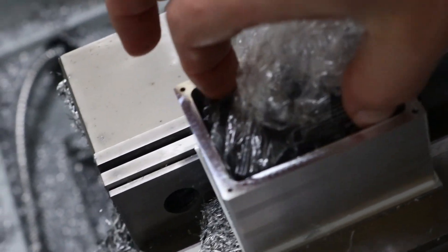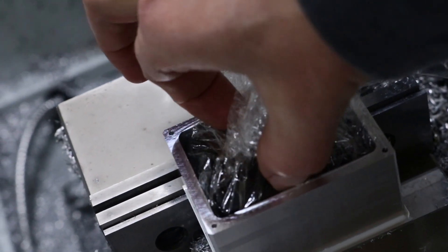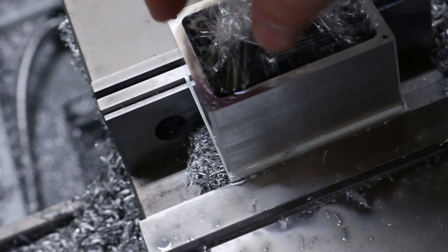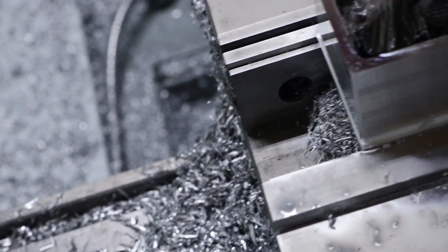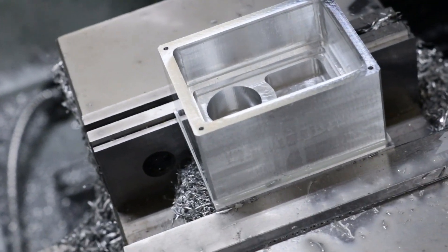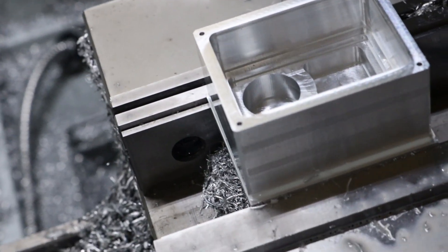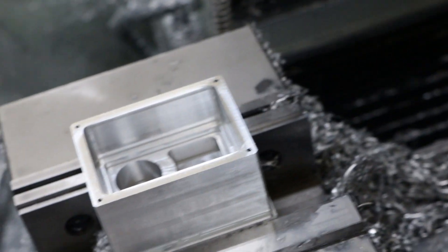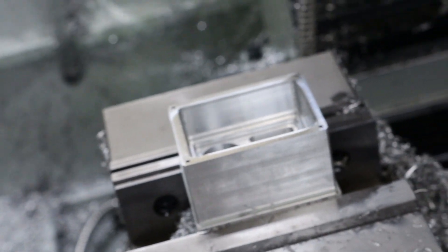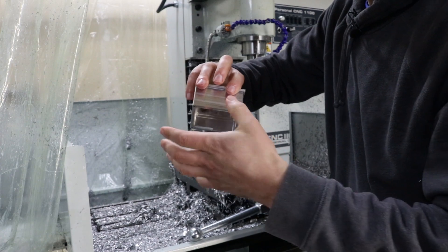You can see it kind of sits in that front plate that I showed in the CAD. It keeps it from twisting even though there's a bit of a gap between the camera and the case. The reason I put that gap there was so it would be easier to get the camera out — you can stick your fingers in and pop it out. It was also sized to the max dimensions of the GoPro series so I could swap that plate out later if I wanted to. I think that'll work. I'm hoping — because I run on hopes and dreams — that the Wi-Fi signal will work through there and that little air gap will keep the sensors uncovered.